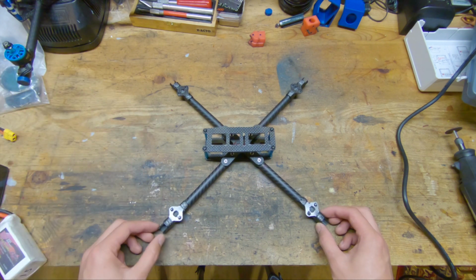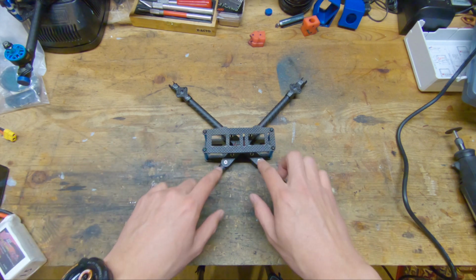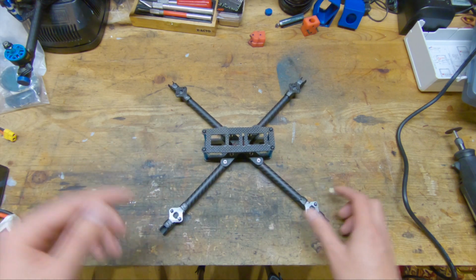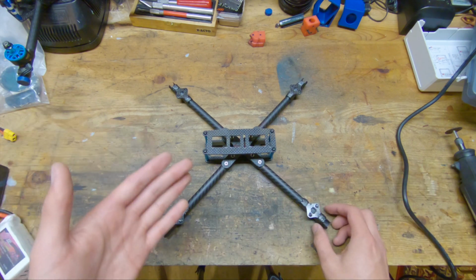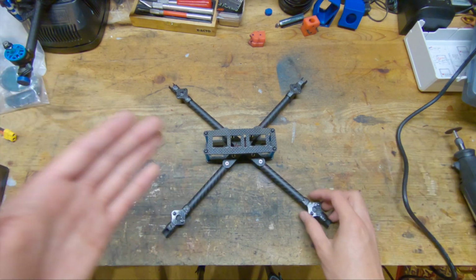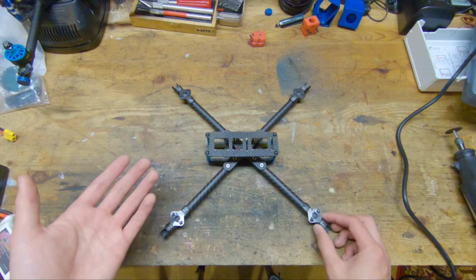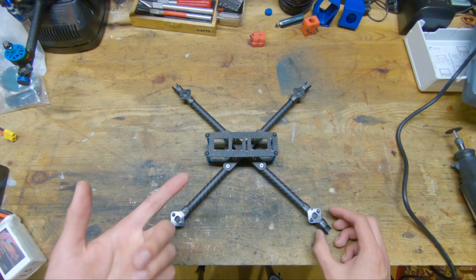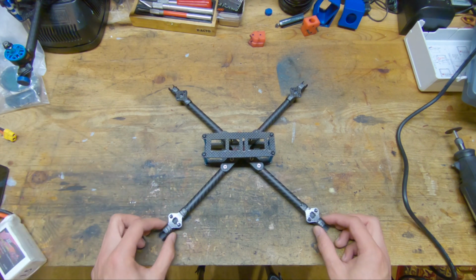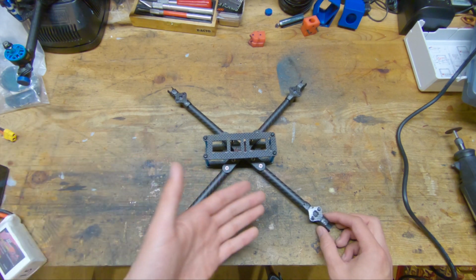So the first thing that I've done is I've used my 3D modeling program to make a drawing with all of the flat carbon components at 1:1 scale. That way I just print out the drawing and I have a template that I can glue onto my big piece of carbon plate. And on that drawing, I've marked the centers of all the holes and things like that so that I can drill all the holes precisely, and then I can cut out all of the pieces.